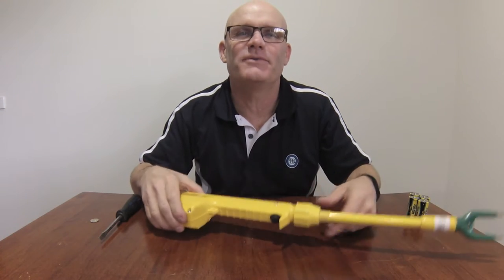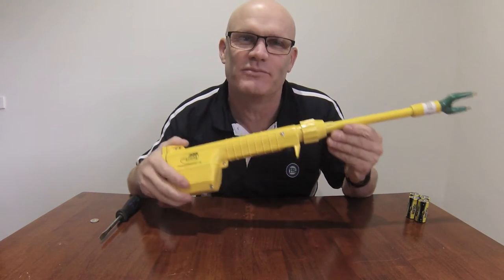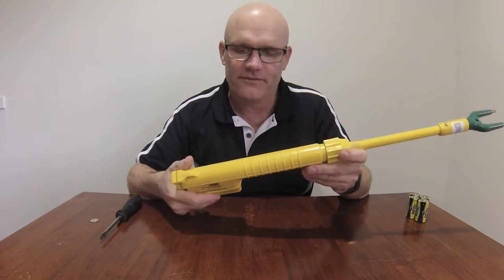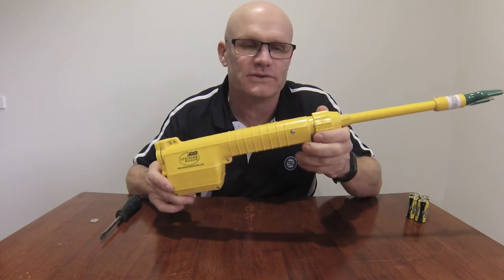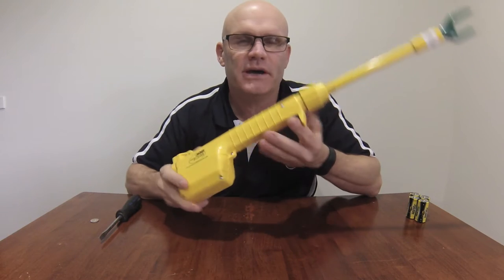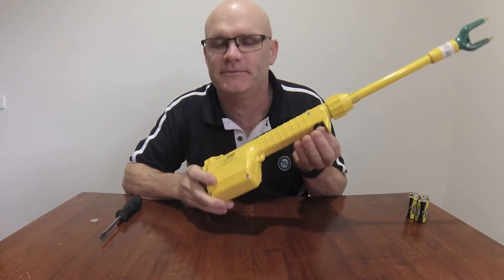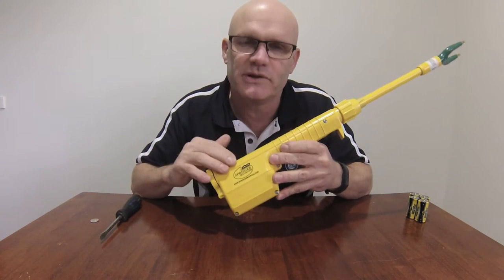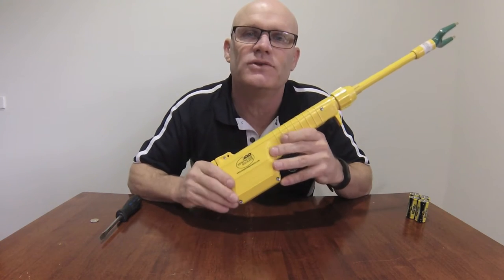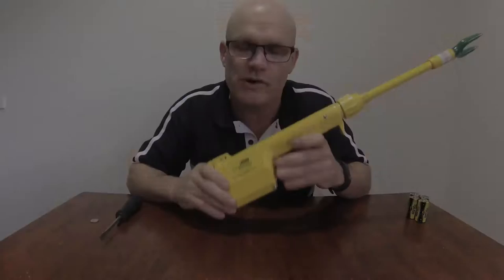Hi, today we're going to take you through the testing procedure for your Magrath stock prod. Now the first thing we need to do is ascertain that the prod itself is not working. So by doing so, what we do is we depress the button and there should be an audible tone. If there's no audible tone from the handpiece, then your prod at the moment is not working.